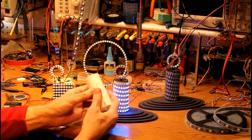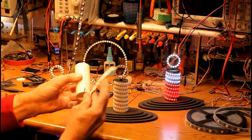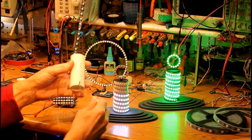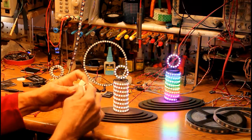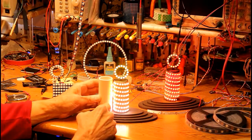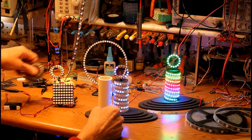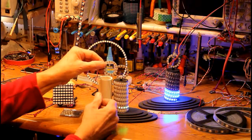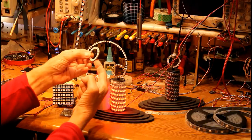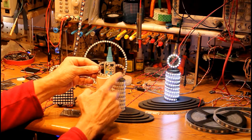What I did was take a piece of plastic pipe, cut a little notch in it so the LEDs start inside of the tubing and then come out through that notch and wrap around. At the top there's another notch where the LED strip can go back in, so all the wiring is hidden inside. Spray painted it black, wrapped them around, and at the top I took the three pins at the other end of the strip and connected those to a 16 LED circle - connecting the out pin to the in pin, plus five to plus five, ground to ground. That gives 144 plus 16 LEDs in this particular array.